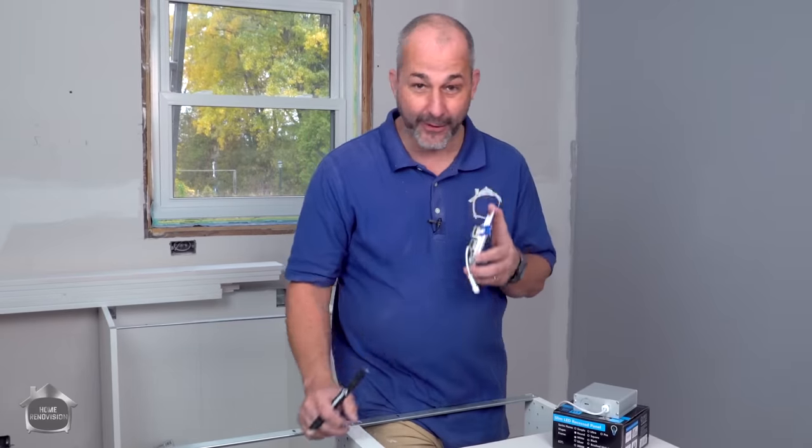Now that all connections are made, tuck everything into the box so the lid will close. The only tricky part left is this: there are two holes for the contacts and another little divot that acts as a guide to make sure the right pin goes in the right hole. Line the guide up gently, press it together, then bring the ring down and go backwards until you feel it click — it's plastic threading and you don't want to cross-thread it.